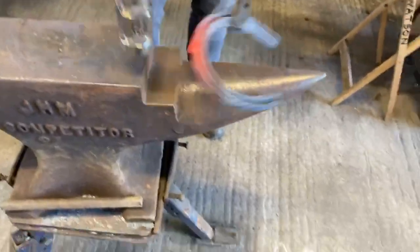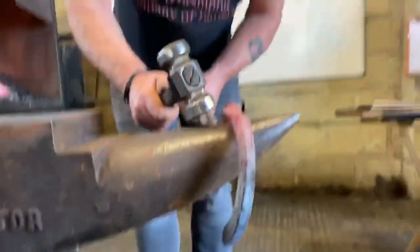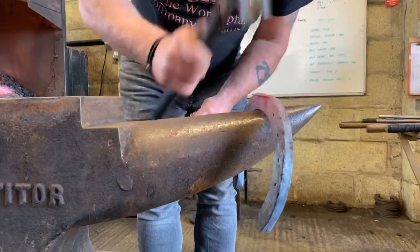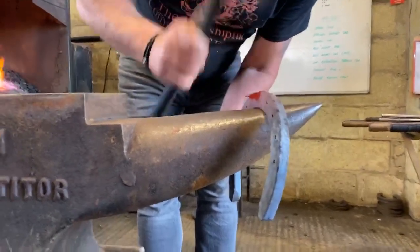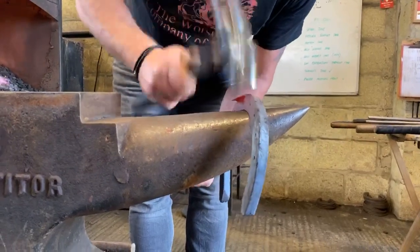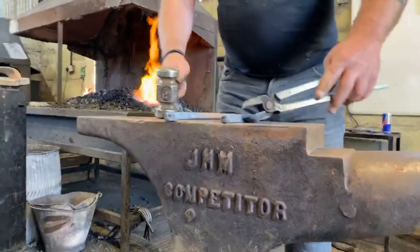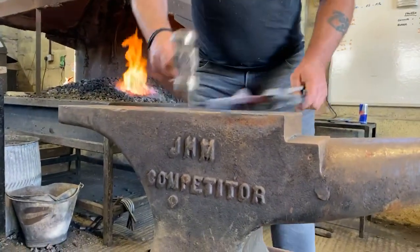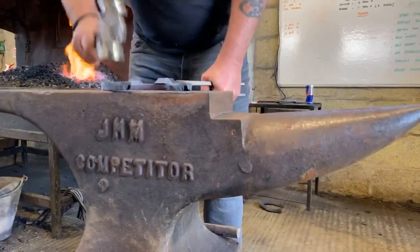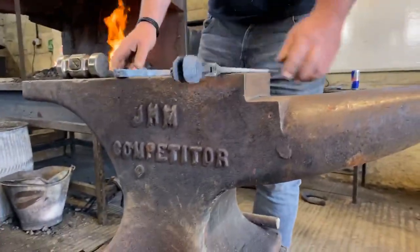Sometimes you see really nice shoes and this outside border is all at the toe, okay? And then lastly, once I've gone straight round the edge, I'm going to set this clip on. So I'm bringing my hammer at a slight angle, knocking the outside edge off, and then just run it through the base of the clip. And I'm setting the base, I'm not hitting the top of the clip, I'm hitting the base of the clip. Okay, setting that on. There you go. Bob punch fit.